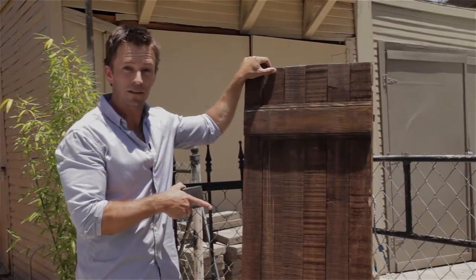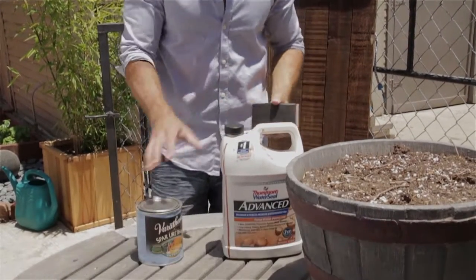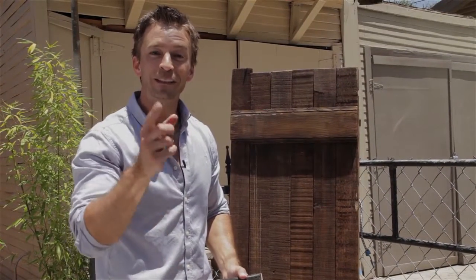This is what the old church door looked like before. I did a light sanding, applied Thompson's Water Seal, and four coats of Varathane, making it countertop ready and leaving just enough rustic character.